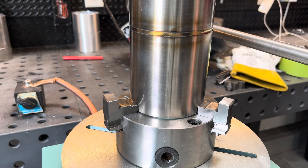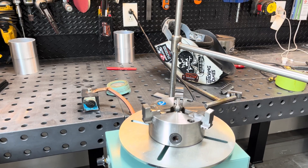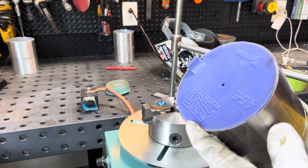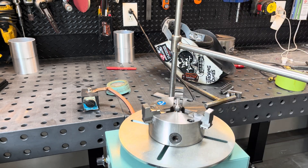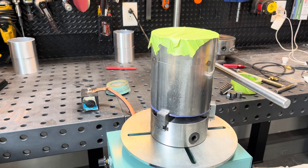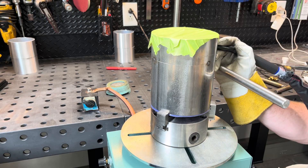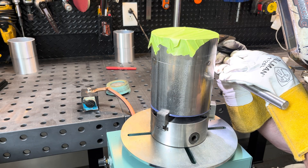You can see there how smooth the positioner is and how good it works. We're going to set up a piece of five-inch here and see how it does. We got this five-inch stainless — it's just exhaust pipe, actually 304 stainless. I've got my TIG Aesthetics purge plug in it. I'm going to get it on there — these purge plugs are sometimes hard to get on that tubing. Let's give this one a go.